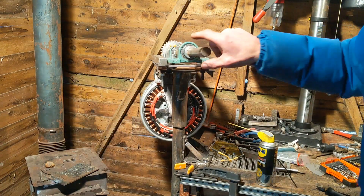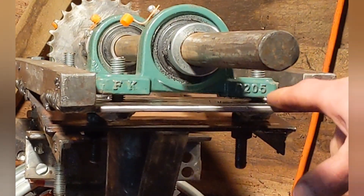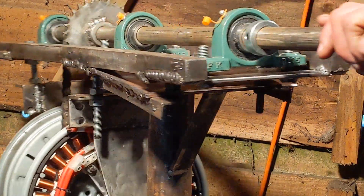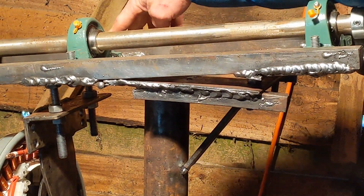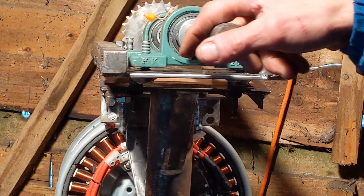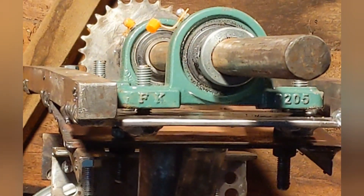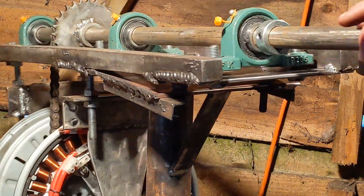Worth noting that because I've put so much weld on here, the frame has actually bent slightly downwards at the front. And what that means — you can see here — is that this bearing is actually raised off the plate. I couldn't get my head round it, because that was all perfectly flat, and anyway, it's because of the welding. So there are two options: dump a load of weld on here to try and get it to come back up a little bit, or the by far easier route is putting washers under here, which won't affect the performance as long as the shaft is perfectly straight. If I was to bolt this down, the shaft would have a tiny little bow in it, and obviously that would be bad for many reasons.